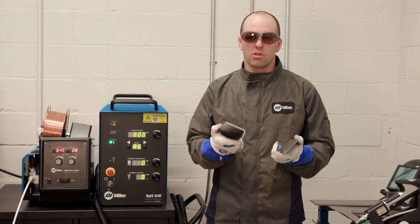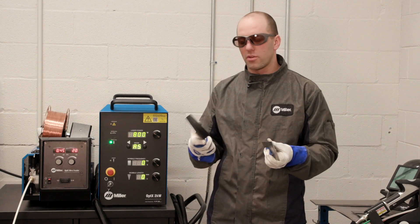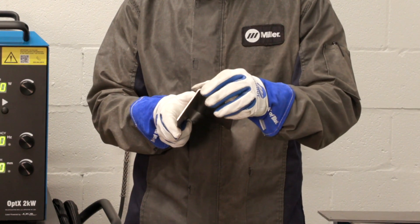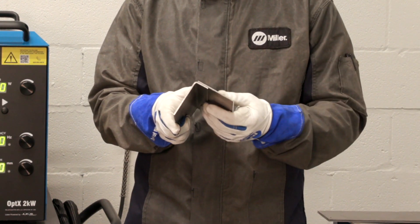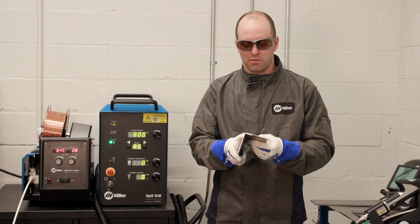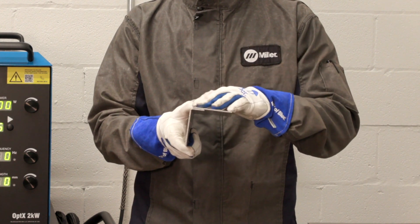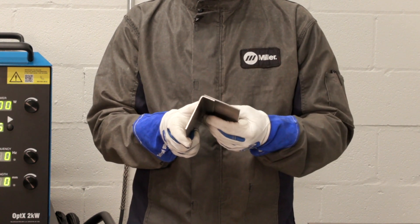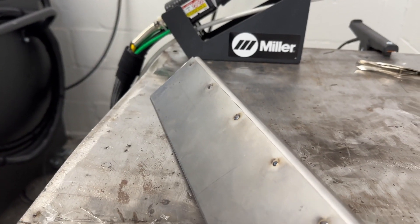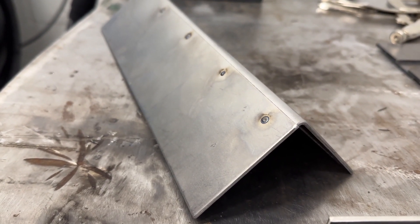If you have the ability to control or design the parts up front, or you're looking to optimize your welding operations for the handheld laser welding system, the best configuration for an outside corner is if you can break the part or put a bend in it and actually have some backer. This does two things: you can use through-sheet tacking down the entire length of the part to hold it in place and minimize the number of clamps needed, and it keeps the tacks out of the way so when you want a long continuous run you have that nice preparation in your joint.